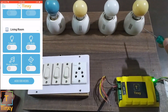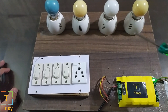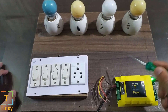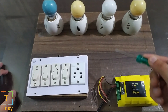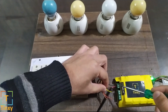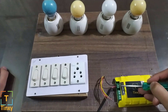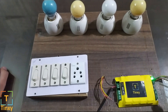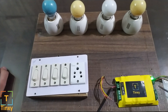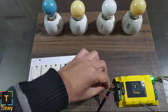So these are our four devices. All four devices will have a neutral already provided by the electrician from when the construction happened in your house. This neutral is going to all four appliances or bulbs — we have connected the neutral here. Now let's connect all these wires. Be very careful when connecting these wires because this is where the 230 volt input is provided. The other area is where you will not be providing any 230 volts — make sure you don't provide 230 volts there, otherwise this module will blow up.